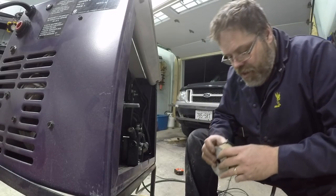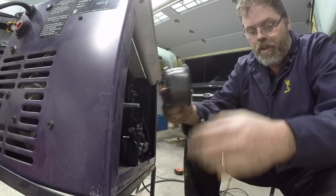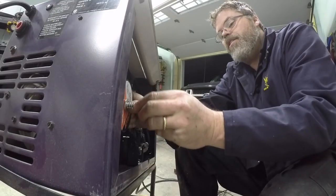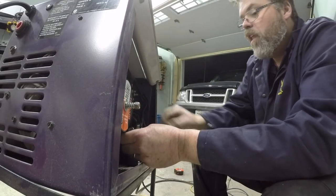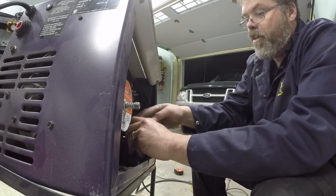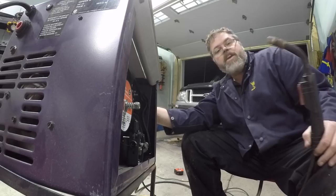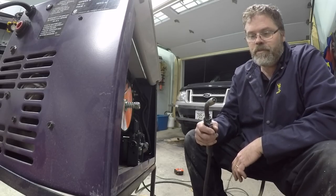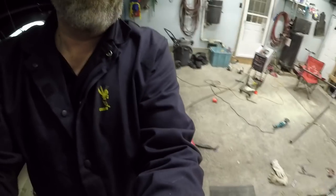Look at that, boys. Friggin' decent. We'll pull this off of here like so. Now you want to make sure you hold this, boys. Don't let her go away because she'll go into a spin overload and then it'll be all dicked. So keep some tension on her until you get her lined up. Now we need the cutters again, because you gotta cut off that one piece so she's a nice smooth line. Then we'll get her lined up in the whole ski. That's it, boys. Flip that back down, tighten this back up, and we'll put her on that. We're on 40 on the feed, so we'll go back to 40. We'll go up to 100 right now just to get her out. There we go. That's how you change the old wire in the old welder. Back to 40, boys.